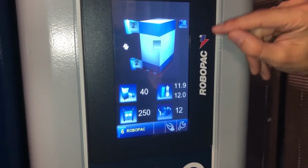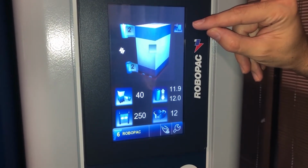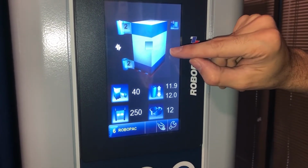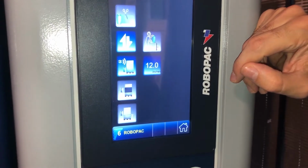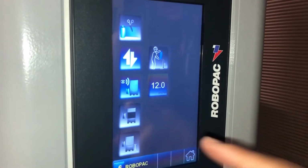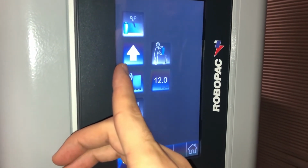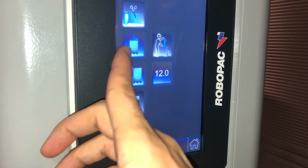And then we have the photo eye that detects the height of the load and when to stop. And then we have a hidden menu, just call it a menu. We have another menu. As we tap it, we can activate or deactivate the auto cutter, which is optional. We can change the wrapping pattern, going up and down, or only up, or with the top sheet option.